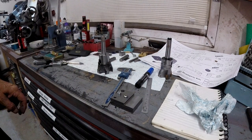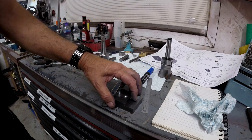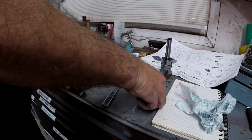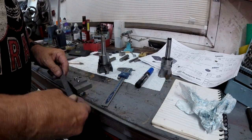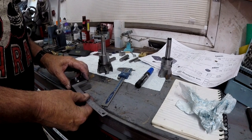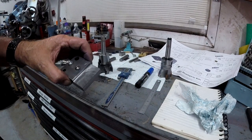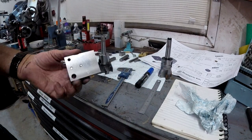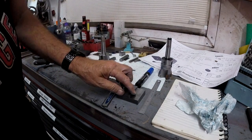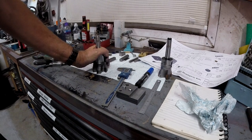I've got some 12mm carbide milling cutters, which you could do in 12, 24, 36. What have we got there? I've only got 25. 12, 24. I could nearly do that in two passes. Tell you what, tomorrow I'm going to do the other side. I'm not going to use them, and we'll try it with a new 12mm carbide bit and see then.